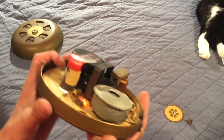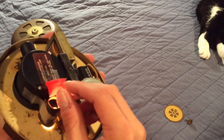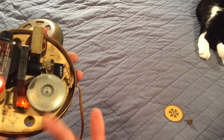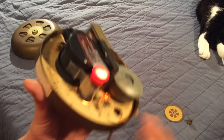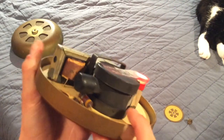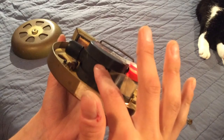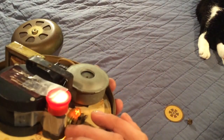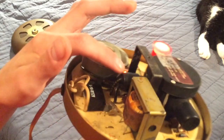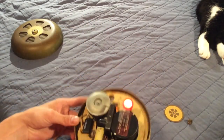Let's take a look at how this thing works. Right here is the lamp cover. If I take off the lamp cover, you can see right down under the regular incandescent bulb. The red lamp cover is sort of a lens that goes over it so that it projects red out in the room, so you'll know that it's working. There's a small little hole right here that it shines a beam through straight in a line to the end cap. That's how it is in normal condition — it's just shining a beam right through. But when smoke enters the chamber through the little louvers at the top and bottom of the sensor chamber, it interrupts the beam, the smoke scatters the beam, and some of that light from the lamp lands on the photoelectric sensor. That creates the circuit and turns on the horn, which sounds the alarm. That's how the photoelectric detector works.